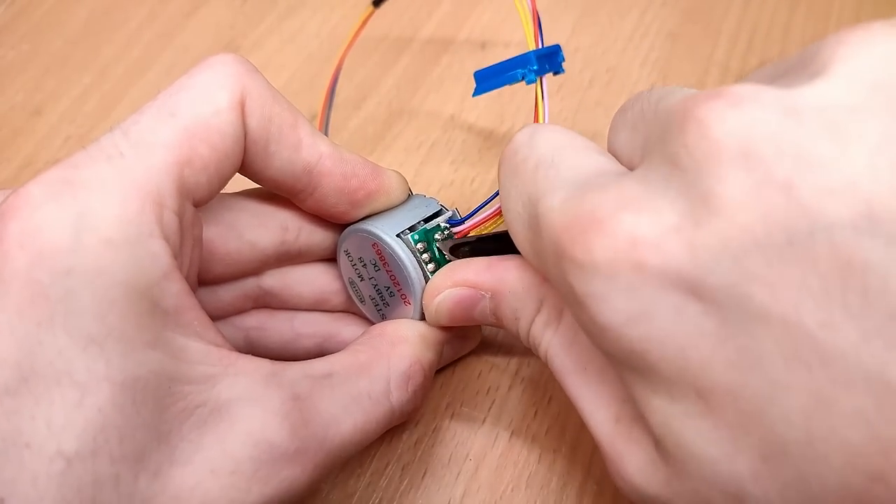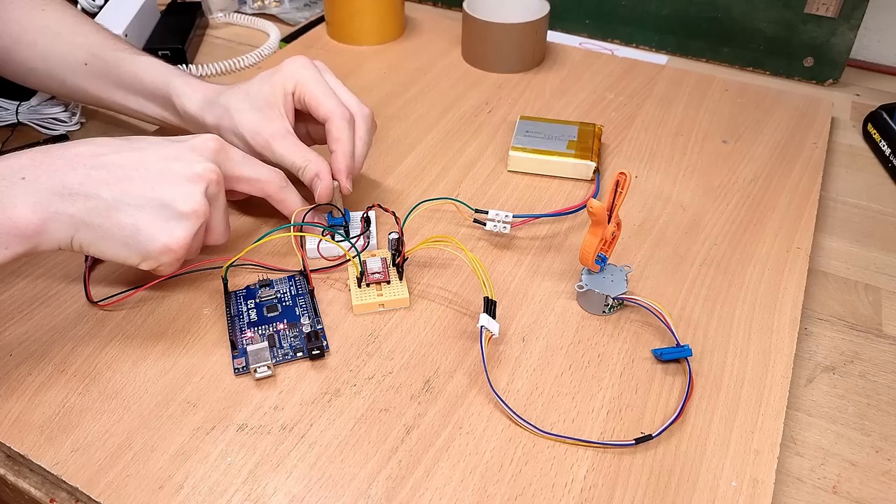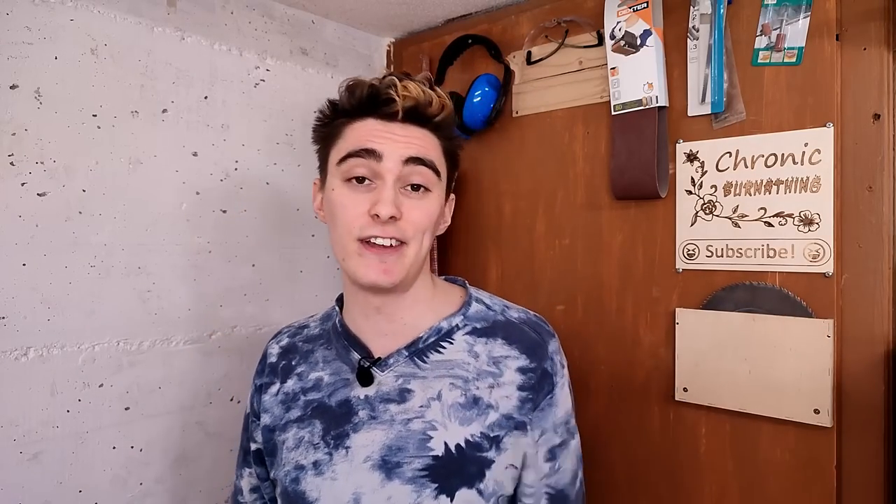There is an easy way to convert unipolar motors into bipolar ones, which allows you to use the dirt-cheap mass-produced A4988, rendering my fancy new invention totally unnecessary. But there's still some advantage to using a stepper motor the way it was designed, plus it's a very interesting novelty problem to solve. Having to compete with a mass-produced item like the A4988 made the design challenge all the more interesting.